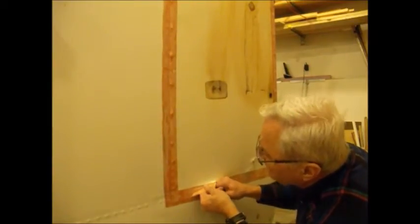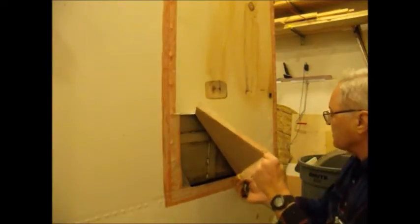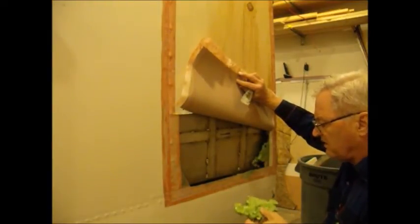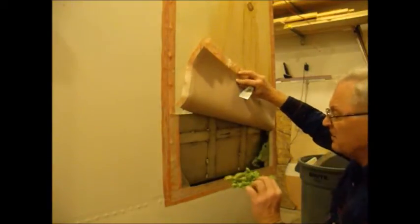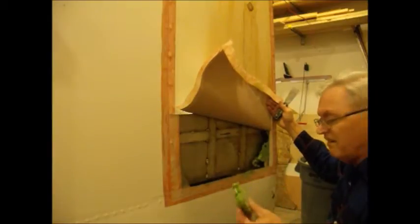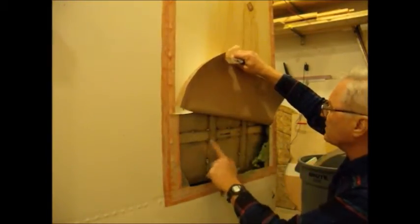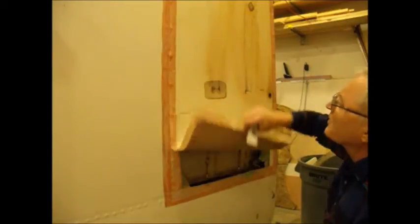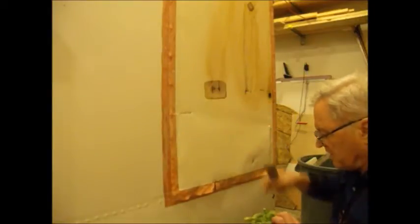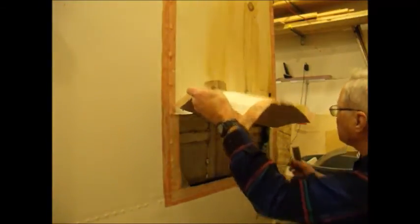Here we are in the back. You can see some of the problems — this is the bottom of the wing. There's some chafing going on here. It's like the other side: there's a bar on the bottom of the tank and a sharp corner, all stained from fuel. I worked the corner loose with a little heat and picking at it. And as I suspected, there's a patch — this has actually been patched once. It still looks like crap, so we need to address the underlying problem.